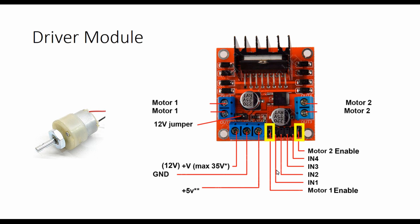There are two enable pins — the left terminal is for motor 1 and the right is for motor 2. When you buy this module, jumpers are provided on these two terminals. If you remove a jumper, that particular motor will not run. The jumper connects the 5 volt signal to the enable pin of motor 1 or motor 2. If you are not removing the jumper, nothing additional needs to be done. The four input terminals are: input 1 and 2 for motor 1, and input 3 and 4 for motor 2.